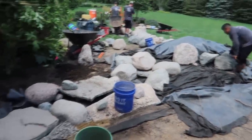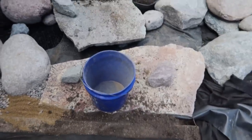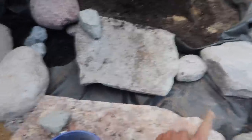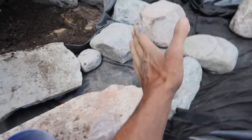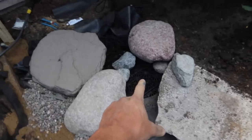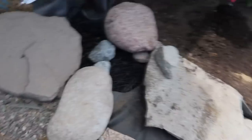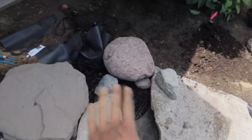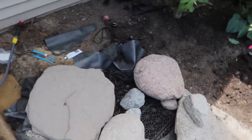We are making some really good progress. We got our steppers in — we got this super cool flat piece that we're able to tuck right up against the patio. We got a nice peekaboo bridge that allows them to see the water traveling between the bridge and into our basin. Our aqua blocks end right about here, but we threw a bib liner in like we normally do to extend that water and make it look more natural. Then it's going to dump down into this area. If there are any leaves and it backs up, it'll flow back behind this cobble — all this will be large gravel as a relief valve for the pondless.